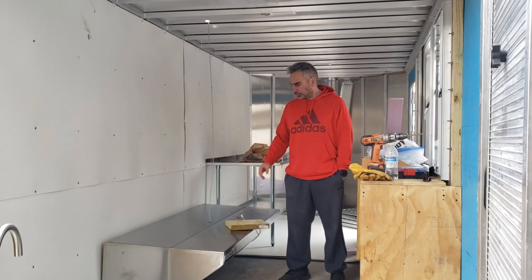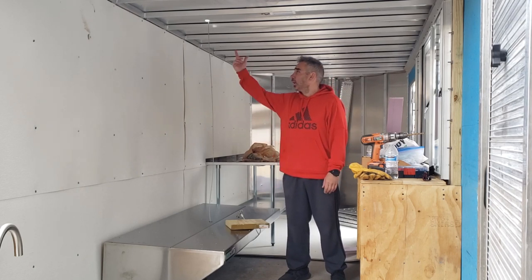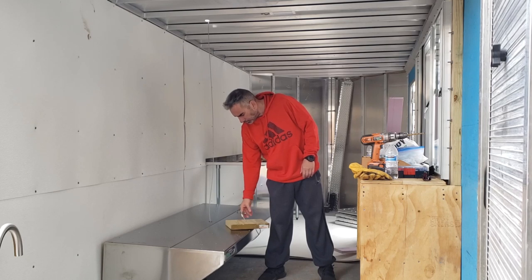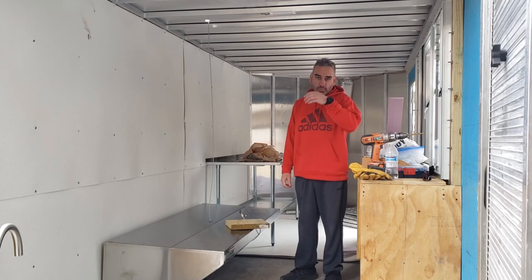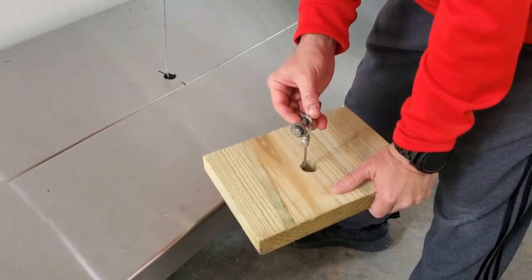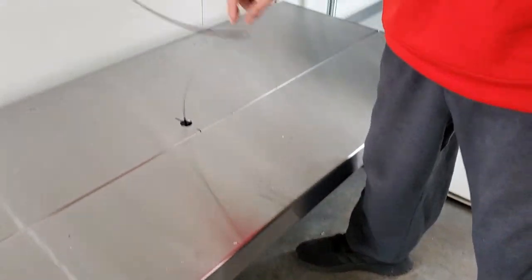All right, today we're gonna try to raise this exhaust hood and bolt it in place. Up above I mounted a hand crank from a boat trailer, and down here we've got this block of wood to hold it up from the bottom. To raise this thing up, I just drilled a hole in this block of wood, and I put the cable through here and this bolt to make sure it doesn't come through. I'm going to set this under here, and we'll start cranking from the top.